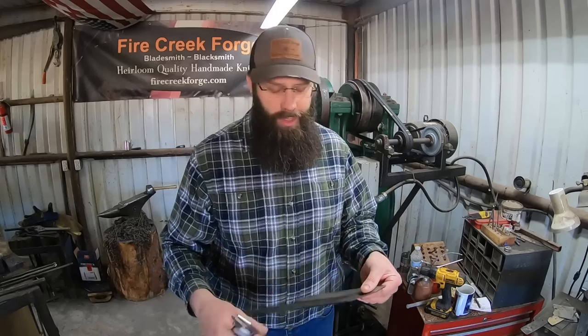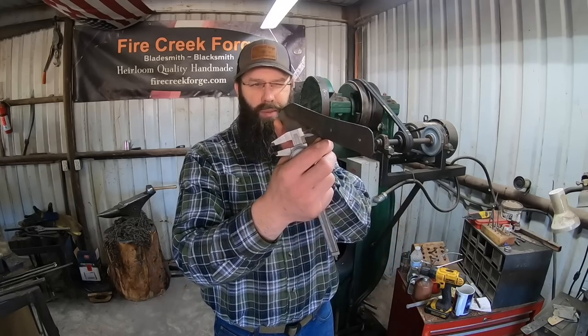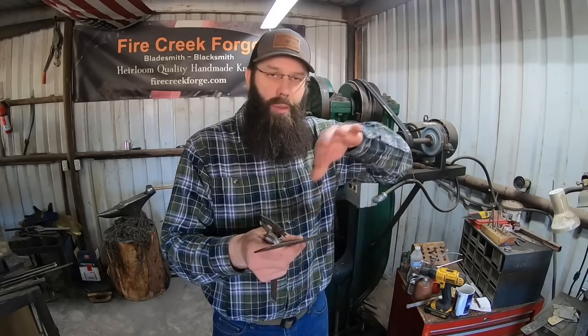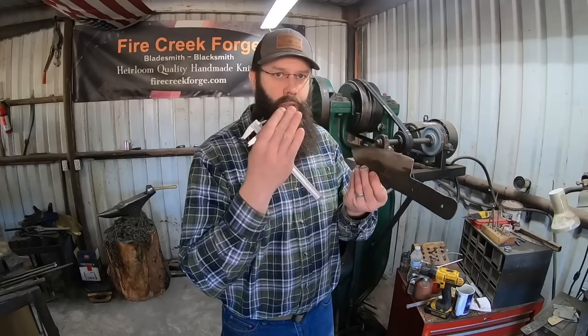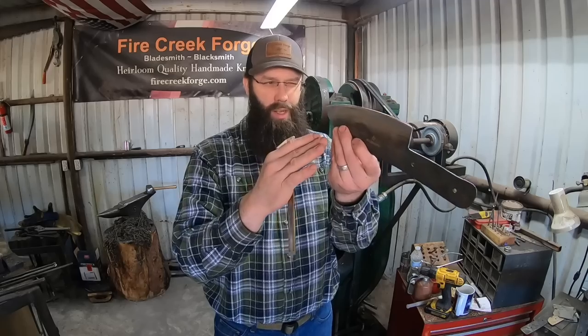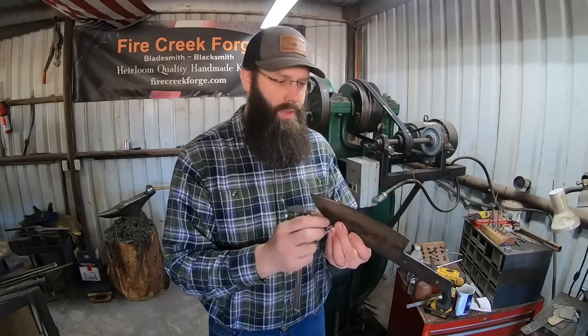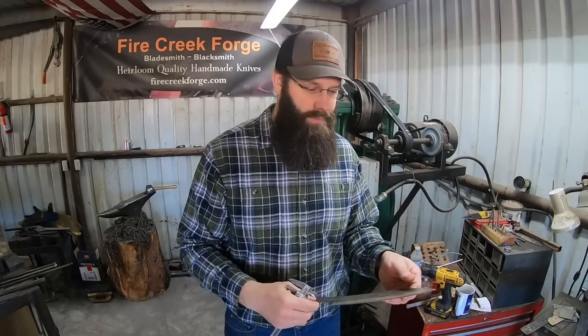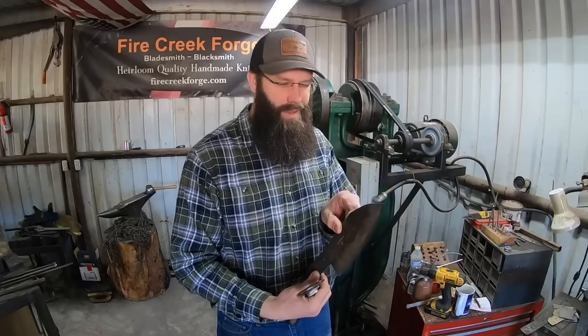And I just wasn't able to get it to work. The spine is quite straight. The edge is not. And so we have a compound warp. It's not just bent this way. It's straight this way, but once you get up to here, you've got different things going on. And so that edge is not straight. And I simply can't sell this. This is simply not acceptable.